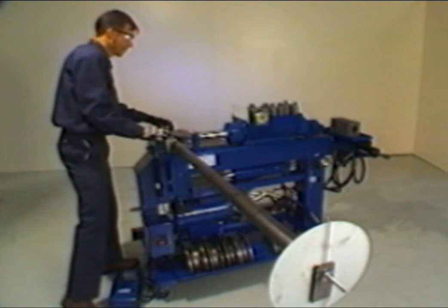With the half shoe in place and the second center mark lined up, advance the radius die forward until the pusher block springs are compressed and the tubing is held securely. Now, rotate the tubing so that the dial indicator points to the proper setting as shown in the pipe rotation section of the card. In this case, the pipe rotation will be 147 degrees.